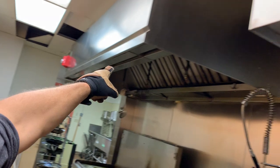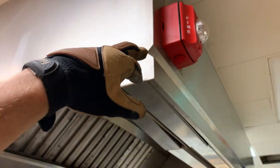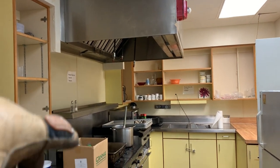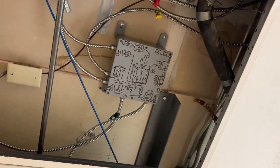The tricky thing is that they wanted these two on that big tank I showed you with its own horn strobe, then this one — the kettle — did not have suppression heads coming down, so they didn't care about it, but it had a horn strobe here. So we decided to wire that. The tricky part was that we were in a second kitchen, and all these horn strobes have to go off together with the Buckeye normally-open/closed switch. Same thing — power kills, lights die, the makeup air dies, the exhaust goes on. Inside here is a contactor that we did.